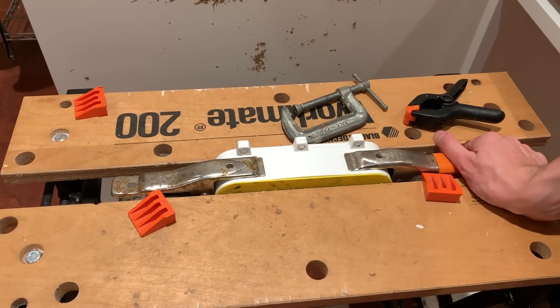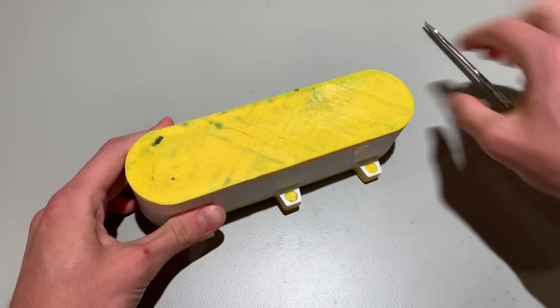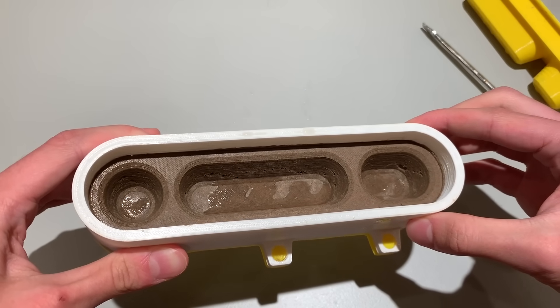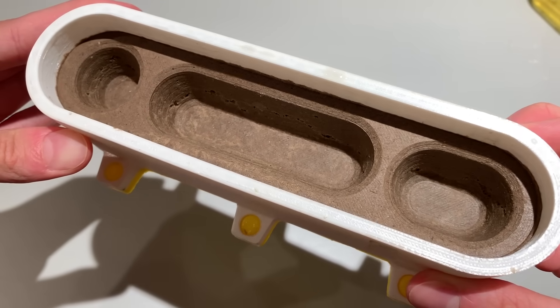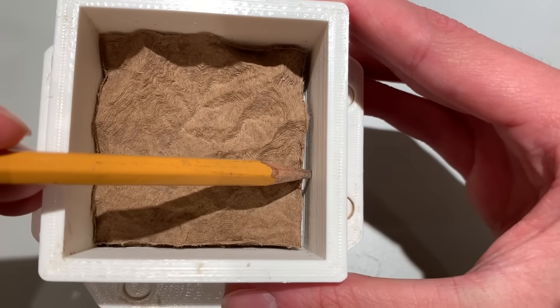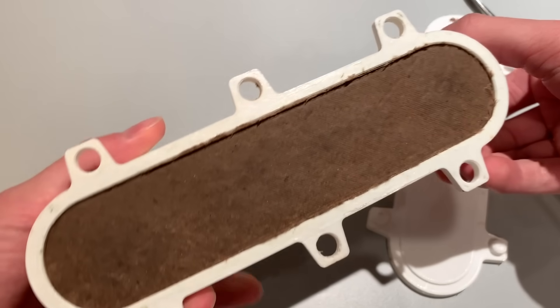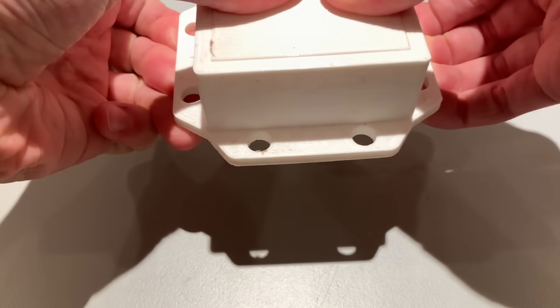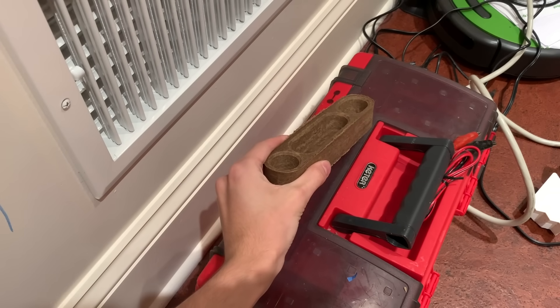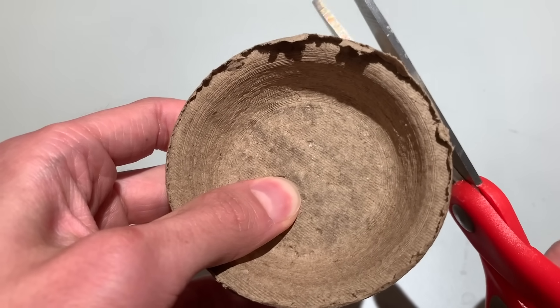Once you're happy with it, leave the mold in the vise for 24 hours. After that, open up the vise, take out the mold, take off the clamps, and use a screwdriver to lift off the pressing tool. You should be met with a slightly damp surface of molded cardboard. Leave the wall and base on as the part dries — as it loses water, it expands slightly in the axis of pressing and shrinks in the other two. After a day or two, detach the base and push the part out of the wall, then let it dry further on a flat surface near a fan. The last step is to trim off any flashing where pulp squeezed between the mold pieces — snips and scissors handle this easily.